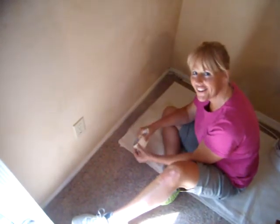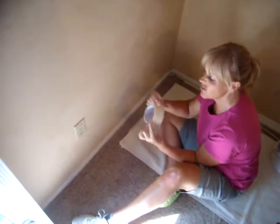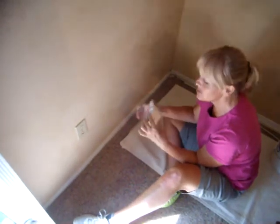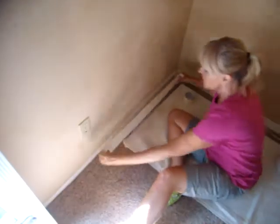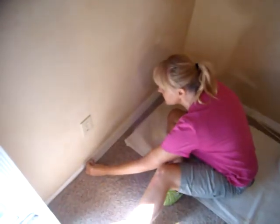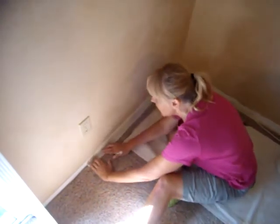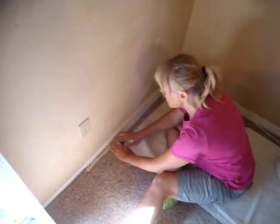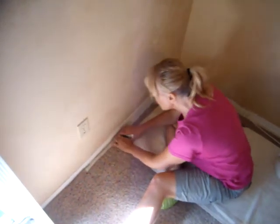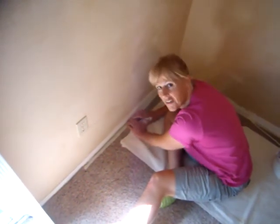So I'm going to show you real quick how to do that. You take a two-inch roll of tape — this isn't really two inches, but they call it a two-inch roll of tape. Get a strip. You put it against this halfway up or about a third of the way up, and then you curl it down and push the rug down at the same time. So you're getting the rug out of the way at the same time that you're protecting the rug.